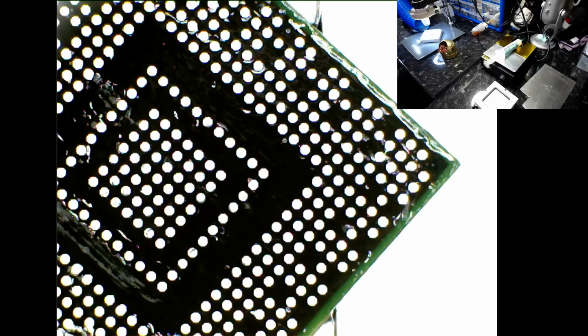It's not clean. Let me wet my sponge for the tip of the soldering cartridge, because it's not as clean as I would like it to be. That's better. Keeping the cartridge clean and tinned effectively means a longer life expectancy of the tip itself.